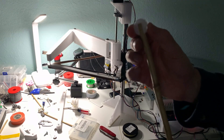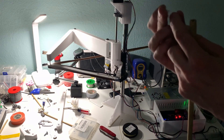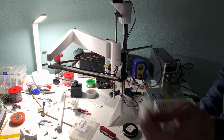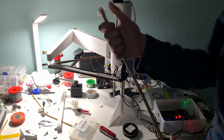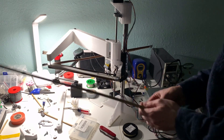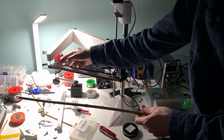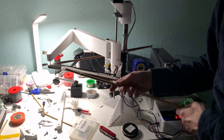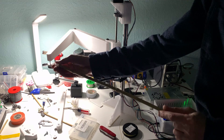I'm planning to make bamboo stick arms. I'm thinking I'll actually use cut bamboo, but natural bamboo also works — you just have to size the connector, and luckily with 3D printing that's no problem. You size it exactly to your bamboo stick. Here I didn't size it quite right, so I had to put a little bit of tape to make the stick a little wider. The replacement idea is basically that the intersection point will be attached to the belt, not to the stick, so any dimensional changes in the bamboo won't matter as long as it provides enough tension. I'll probably install a spring to maintain consistent tension regardless of any deformation in the bamboo.